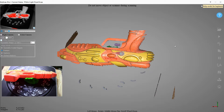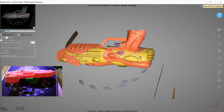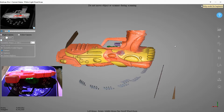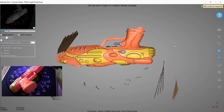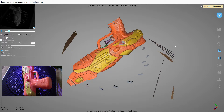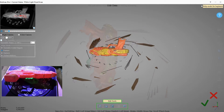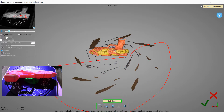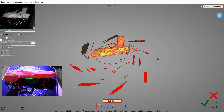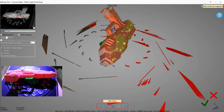You can really see how fast this is compared to photogrammetry, which wouldn't even be able to handle most of these smooth areas. I don't think I would even be done taking the pictures by now, and I'd still have to wait several hours for all the processing to finish. And here we are, we're almost finished with our full scan. One thing to note: if you're using the turntable coded targets option, you don't get all of this extra stuff to clean up — so if you can use that option I would, because it's a lot faster and you don't have to worry about deleting all this stuff all the time.